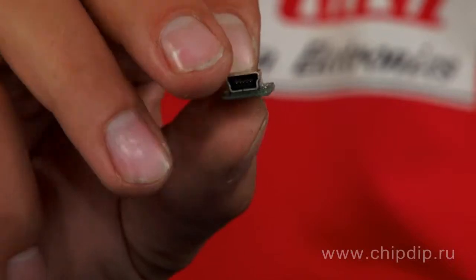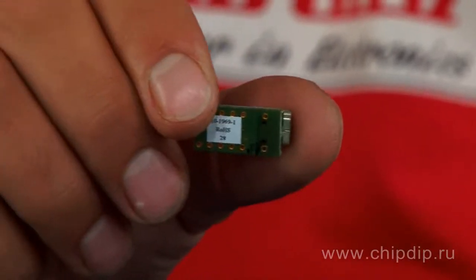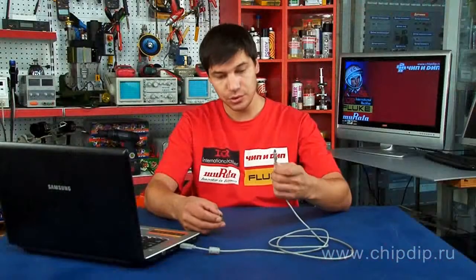Iomate USB-1, manufactured by the company Chip45, is a universal interface adapter designed to connect microcontrollers, field programmable logic devices (FPLD), and other similar devices to the USB bus. It is a replacement for the interface adapter Little USB, which has been previously manufactured by the same company.